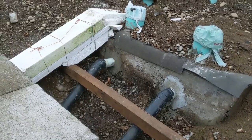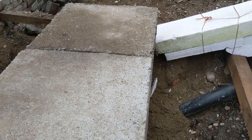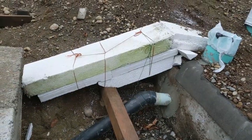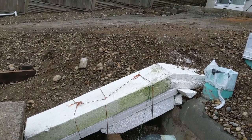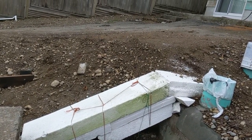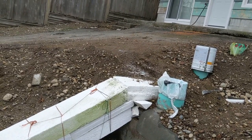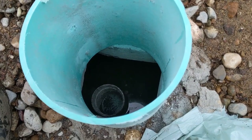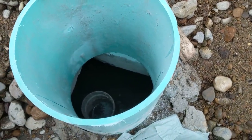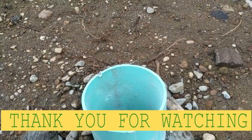Yeah guys, like you see here, my septic tank is repaired, everything's in place. We raised this distribution box because we have it in here, that way we can access it when we pave. That one there — because I'm gonna have a bathroom down in the shop, the pipe is a little bit close to the surface and I'm just concerned about freezing. I just wrapped it with exterior foam, 5 inches on top, 5 inches on bottom, and wrap it all around in exterior foam — that way it helps a bit. The septic tank is working good. Once we have the paving, I'll cut it and put a lid on all of them. This pipe is just for access — like you guys can see, nice and clean — that gives us access to the septic tank. We didn't have access before, it was all covered up. Now we have access to clean it, to do what we need to do right. I love you guys, see you soon.